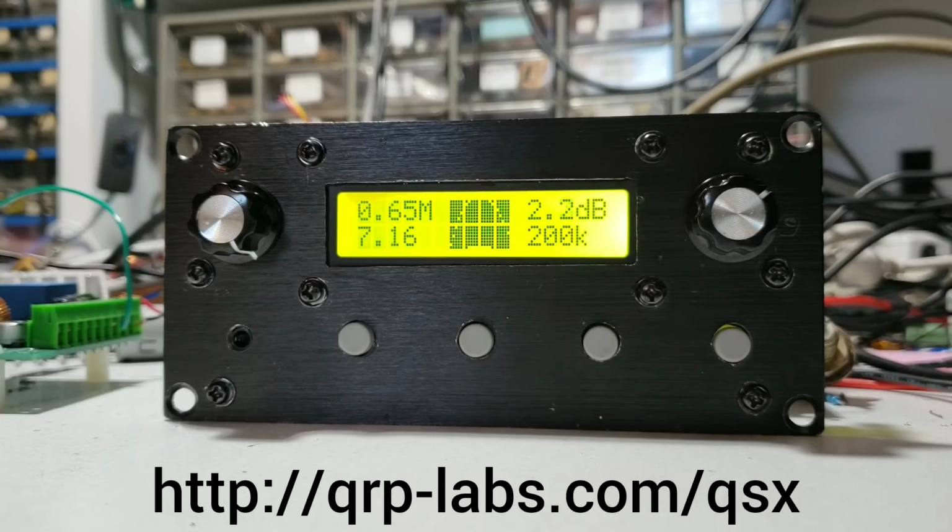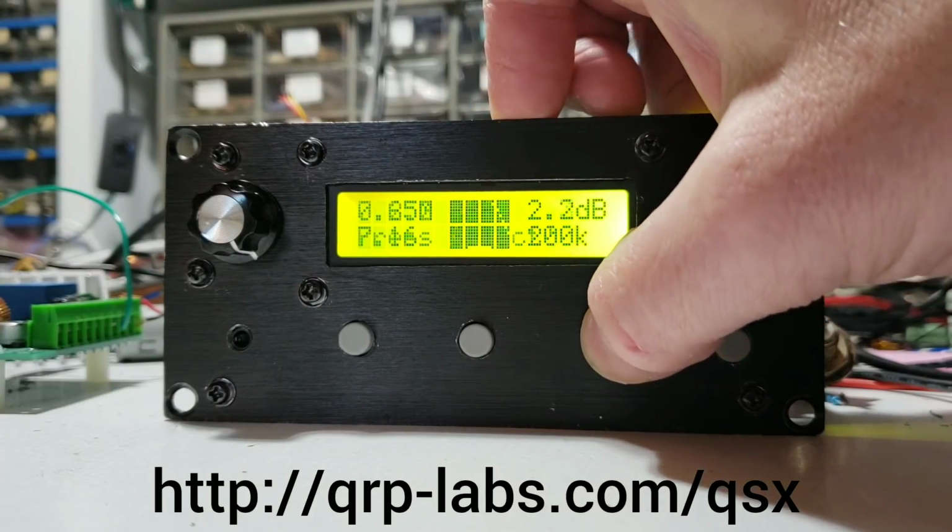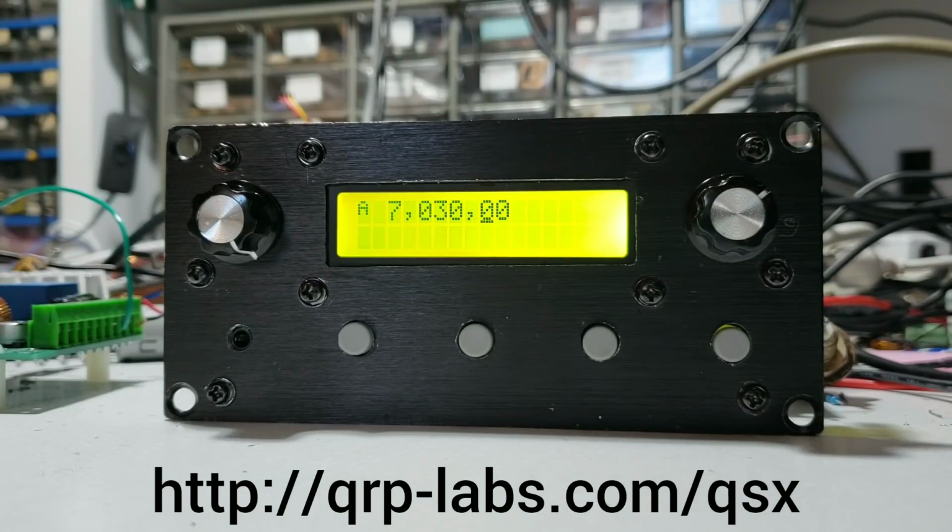So there you have it. It's a very nice and unique tool to have built into a radio transceiver to help align its filters, and goes one step further than just seeing an amplitude measurement, being able to actually plot the filter response is really interesting. It will be also quite educational for many people who haven't got access to a spectrum analyzer and who perhaps haven't used one before, to be able to see how they behave. Essentially, it behaves pretty much like a real spectrum analyzer, of course with a very limited display and limited functionality, but good enough to sweep through the filter performance with its tracking generator. So there we go. Now all I have to do is finish the rest of this thing.